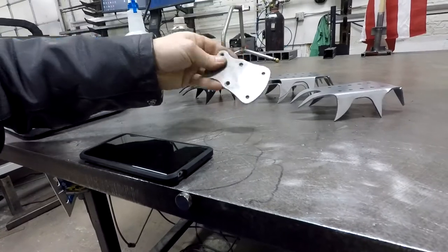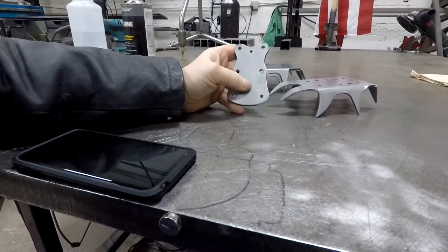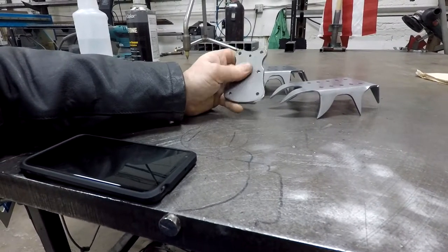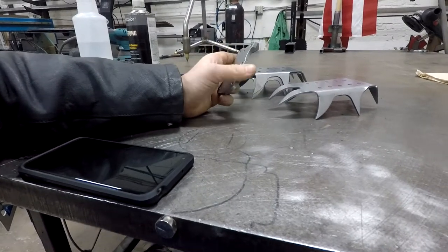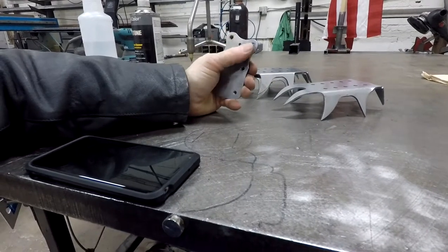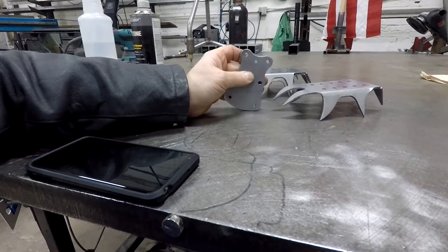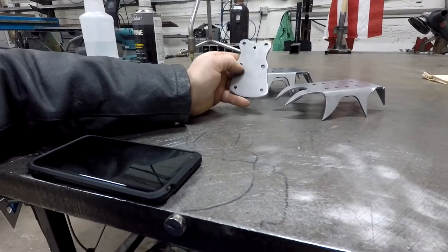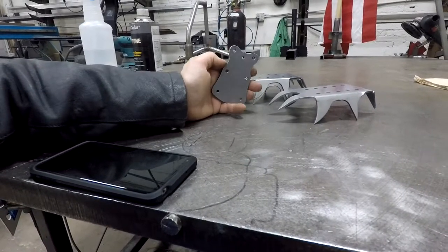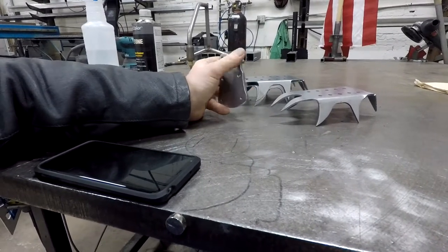I'm going to have to make a couple more of these. I was debating whether I should make them out of aluminum or steel. Steel has the benefit of the weight for kind of working like a dead blow hammer, so you have this force behind it. The problem I have is cutting this out on plasma, which is perfectly fine, but drilling these holes out in the exact proper place is easier said than done. I would love to CNC machine it, but I'm not going to CNC cut out all these pieces because it's not an efficient way to do it and it's hard on end mills.